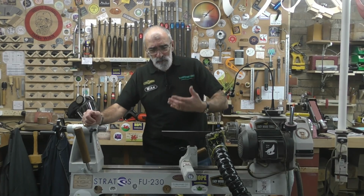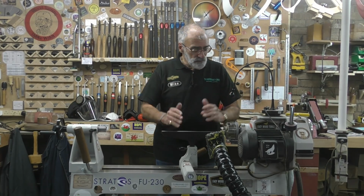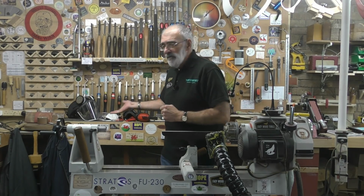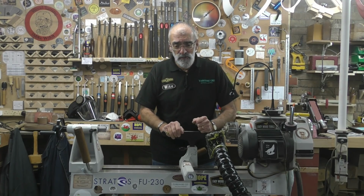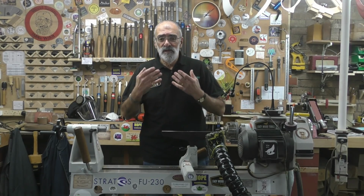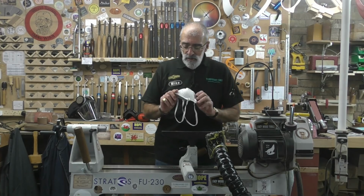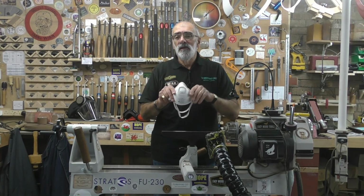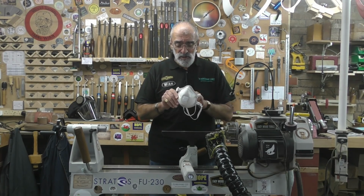The next thing, and possibly not more important but as important in every way, is protection against dust. Now when we're actually turning, if you're turning wet wood, etc., there's very little dust being produced, and maybe a dust mask is not necessary. A face mask obviously, but maybe not a dust mask. But as far as dust protection is concerned, what can we do to prevent it getting on our lungs? Well, my opinion, very, very minimum, is a good quality valved reusable face mask. Again, they're relatively inexpensive, and it does save a lot of trouble in the future regarding dust on your lungs.